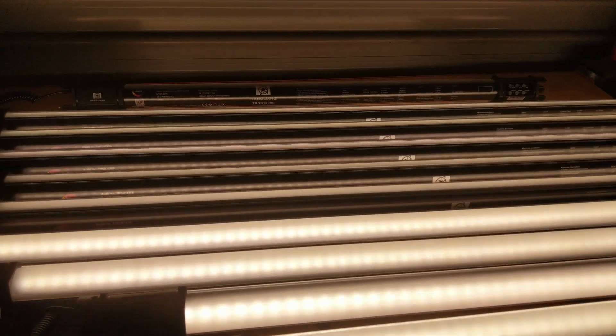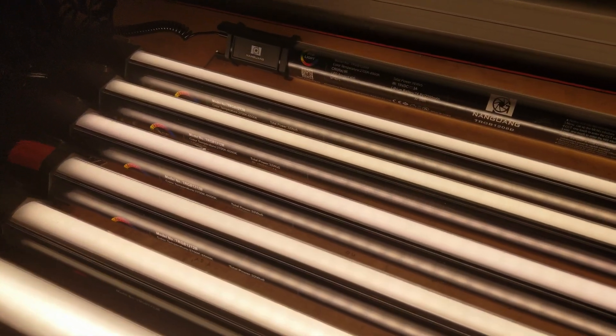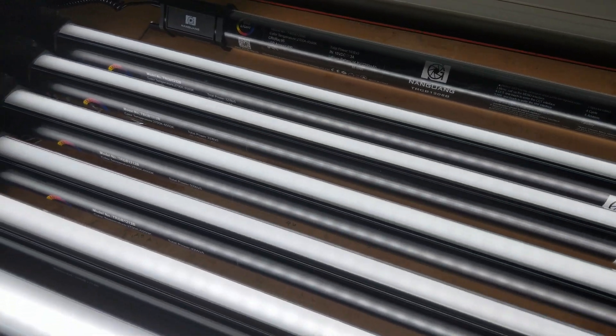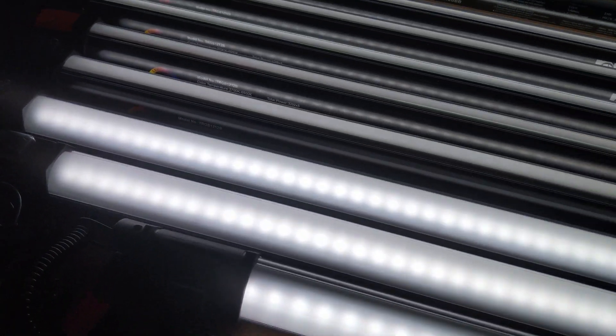Let's get into another fault that I've found. The next fault I've discovered in master and slave mode happens only if you're running more than 10 tubes. At the moment I've got 11 tubes running just to show the fault. They're all running fine, you make your adjustments, they all time into each other. When you've got more than 10 tubes running and you're making adjustments to your colours, some of the tubes will flicker — that one's pulsing away. So I'll demonstrate that with 10 tubes: I've turned off number 11, so no pulsing's going on.